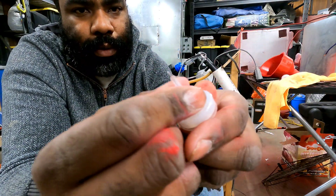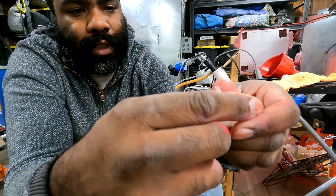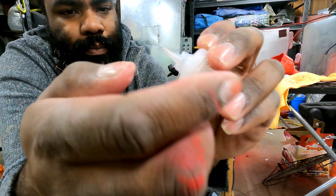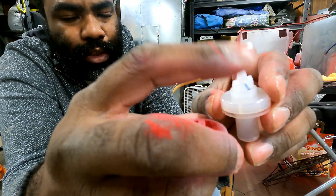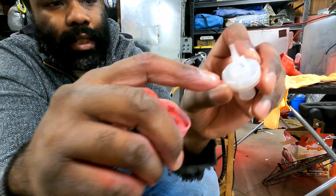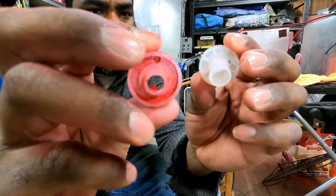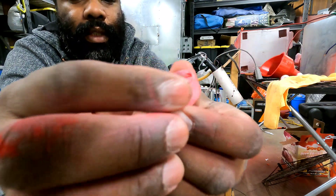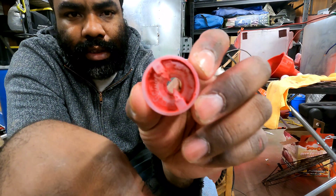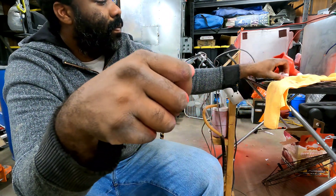This is the electrode — on the Chinese version it's literally just a resistor inside. What I did is: I had the same thing as this but not so deep inside. This one goes almost all the way through; mine just sat on the tip. So all I did was grab some pliers and cutters and cut that piece off — now it's just open. That's pretty much all I did: cut that piece off and trim this down for the nozzle.